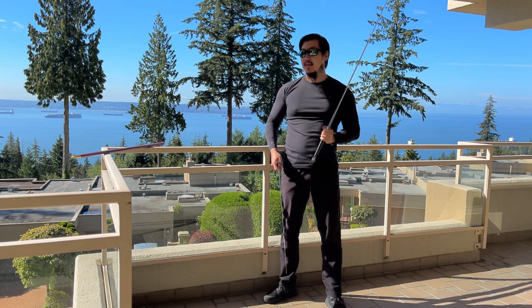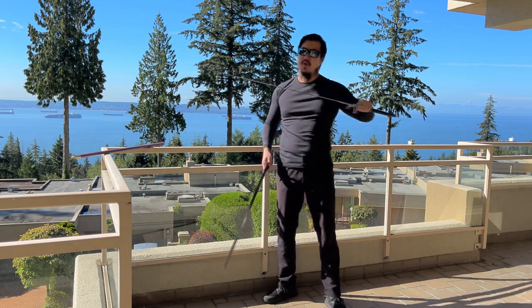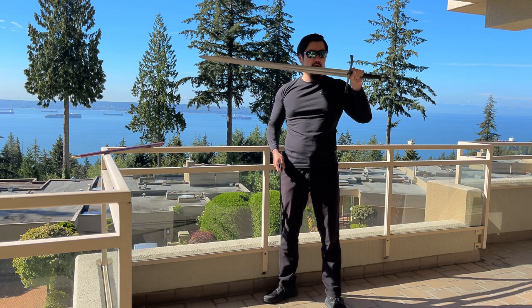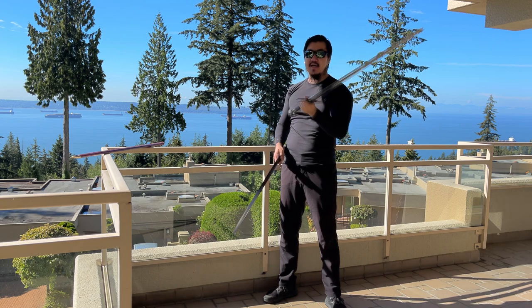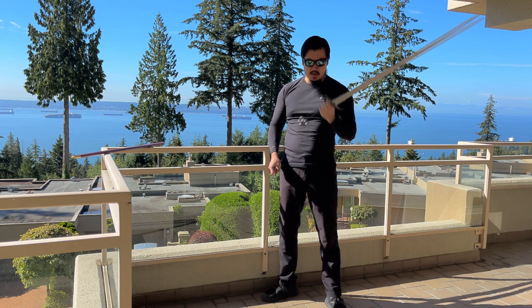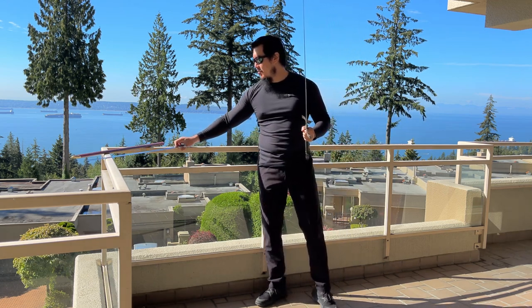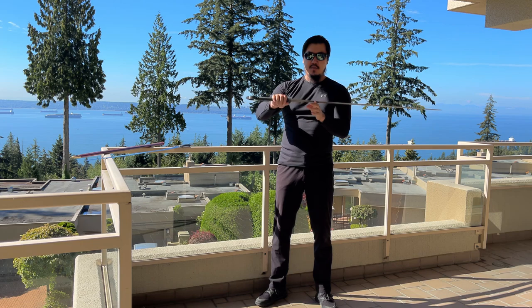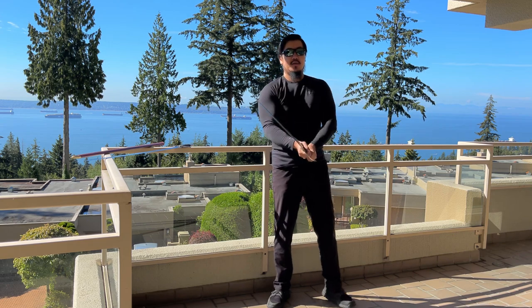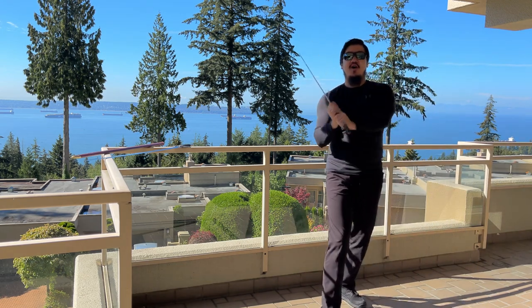Its purpose is to, let's say, unbalance the blade, because this is also a very lightweight blade, very nicely distally tapered, a relatively slender blade for a longsword, and it also has that unique cross section, just not as pronounced as this one. It's a very nimble longsword, lightweight as well, but having this ring pommel makes it a forward balanced one. If you compare these two, you can see the point of balance is also very forward. So even though you feel this is quite light and nimble in the hand, it has a lot of cutting authority.